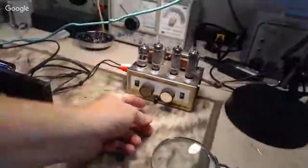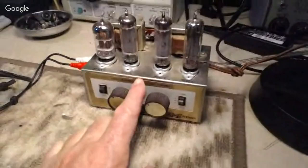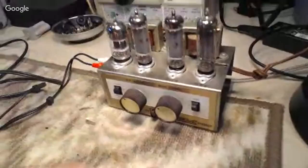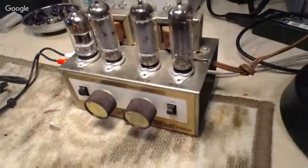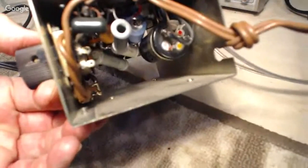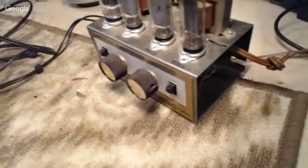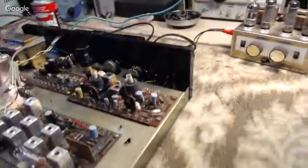We got to be very careful. This is called a line-in amplifier. It has no power supply to it. All it does is take 120 volts and shoot it right into the unit there without benefit of a power supply. Therefore, if you touch the wrong thing the wrong way, you could touch 120 volts. They call these things the widow maker. They're not even legal to be sold in this country anymore. They just use big resistors to step down the power from 120 volts and then convert that to DC power. So they're dangerous, but they're part of audio history, so we keep them.